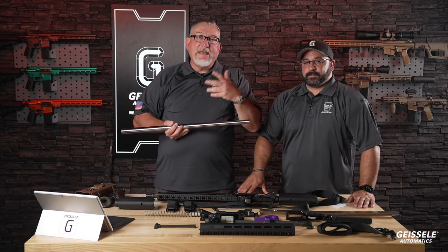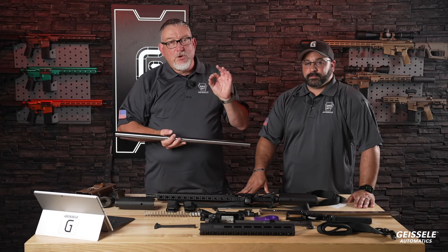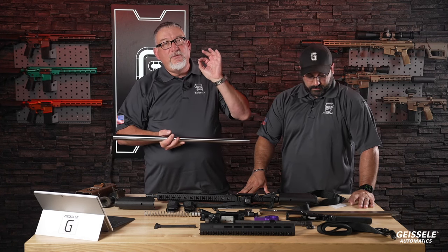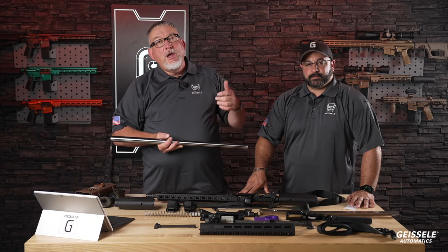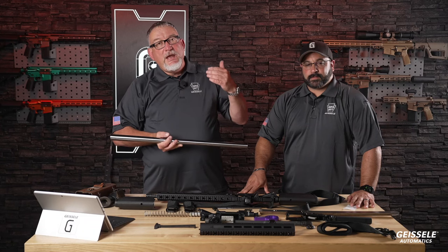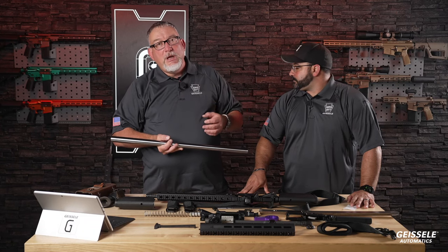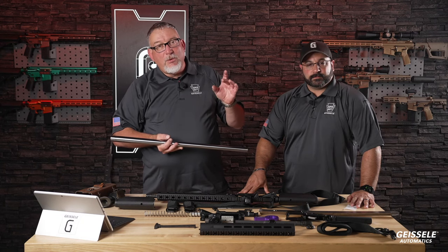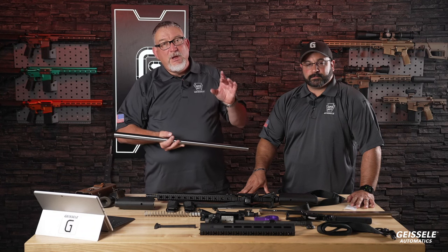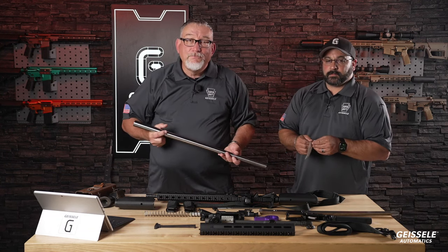Look, as we did gun barrels, we recognized something about button rifling. There's a certain way to do it, and as you get into the very nuances of accuracy, it can be difficult to hold size because of variations in your lots of barrel steel, small variations in hardness, even from blank to blank. There is a size tolerance that I was a little bit too uncomfortable with for absolute accuracy. So we wanted to cut rifle a barrel.